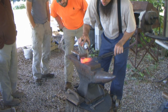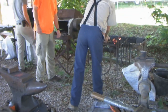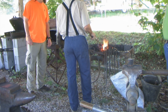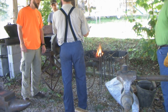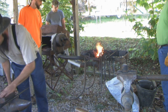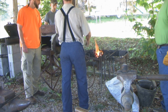Just trickle flux away a little bit, all the way around the edges, and drop a little bit back into the seam. See how much it has turned to liquid. When I get the bottom piece — it really isn't hot — I'll turn it over and I want that welding flux to just be flowing. Just start the spot. And you don't have to have a big hammer and hit hard — it's lighter and faster than a heavy hit.